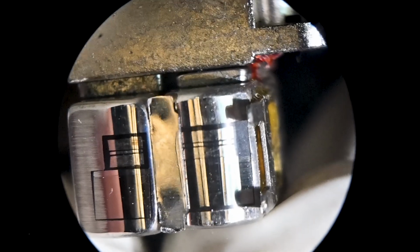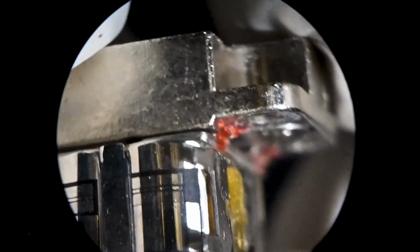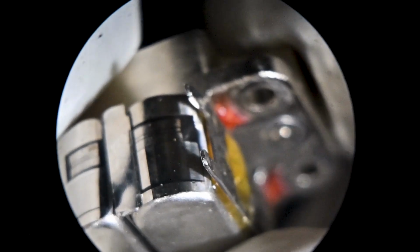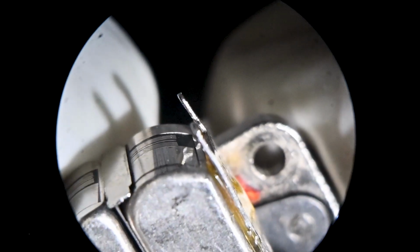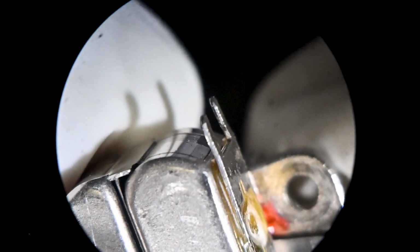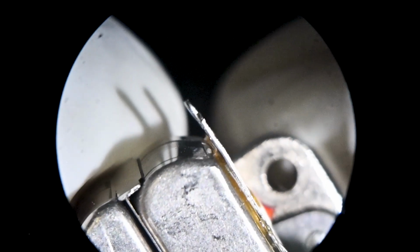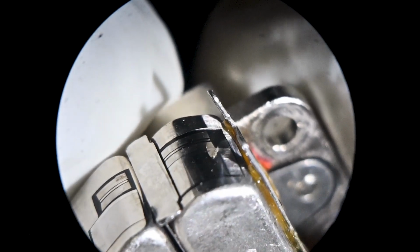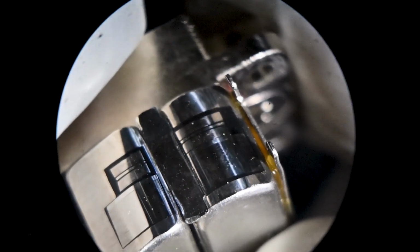Trying to show a little bit of a flat spot. I know it's hard to pick up. This is a binocular microscope, and I can see quite a bit more. But see, the actual part that got lapped was not that bad. It's the guides that aren't so good, and I'm not sure about the radius. I'm not sure about the profile. I'll have to check that separately.